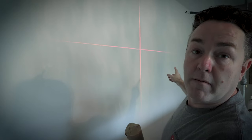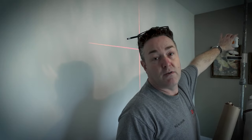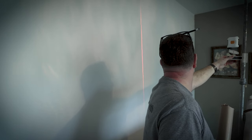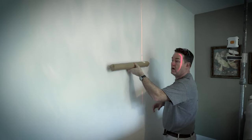Because this is a feature wall I'm going to be starting in the middle. I've got my laser level — I measured up before when I did the lining paper and I knew I needed 1885mm from the side to the middle. I've checked that from both sides, so I know that's the middle. I've got the laser liner on there — you can see it crisscrossing. I only need the vertical, so I've lined that up with the middle.